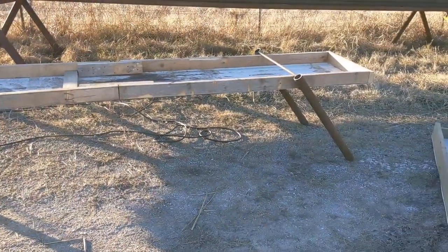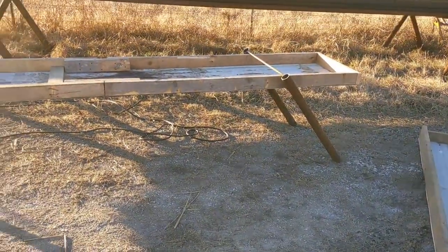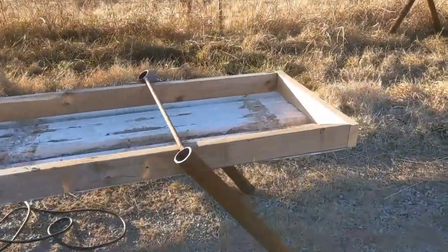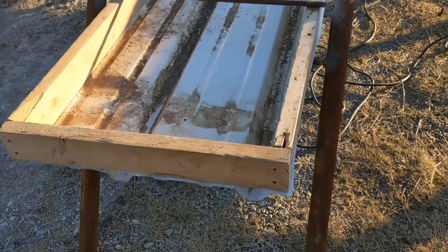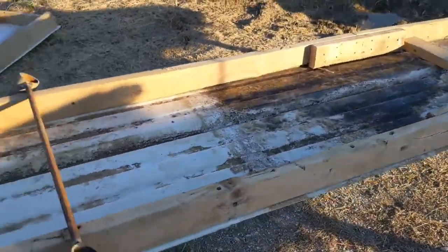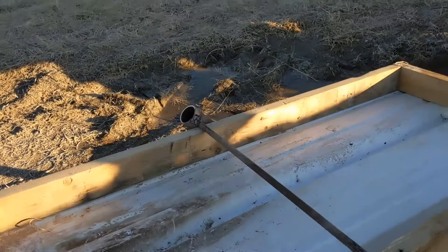That's the first one done. This one will have to be a little bit different because it's two-by-sixes, so it'll be a bigger pocket in there. I did about an inch bigger gap between these two rods than the height of this box including the depth of the rib — worked out to be right at about six inches. It was about five inches tall overall, so for this one I'll just do an inch taller than whatever that works out to be.